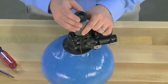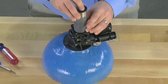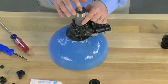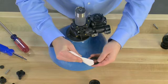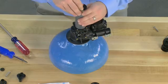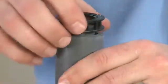We then put a spacer onto the end. Flipping the tool over, we use it to align the spacer and make sure it is in the body nice and snug. We can also tap down as we did with the seals. For the remainder of the seals and spacers, we continue the process to add lubricant to the seals, add them into the body, using the tool to help make sure we guide them in.